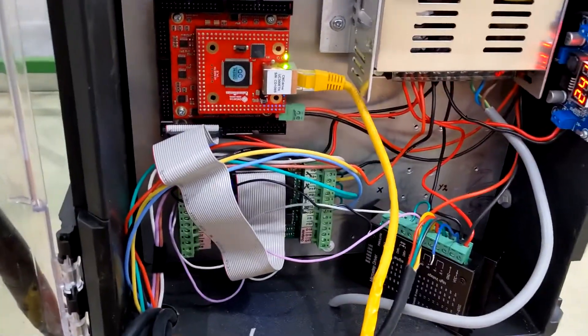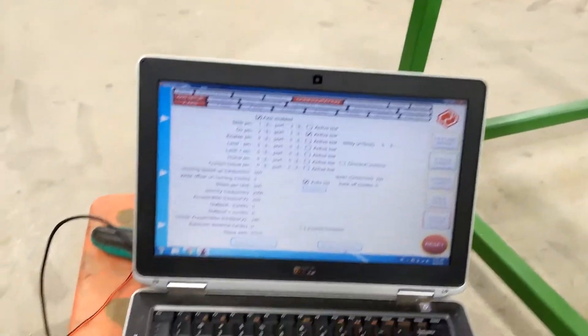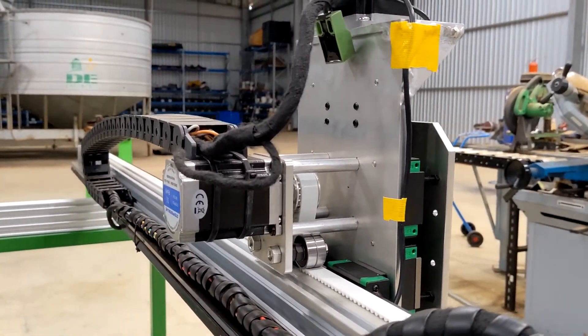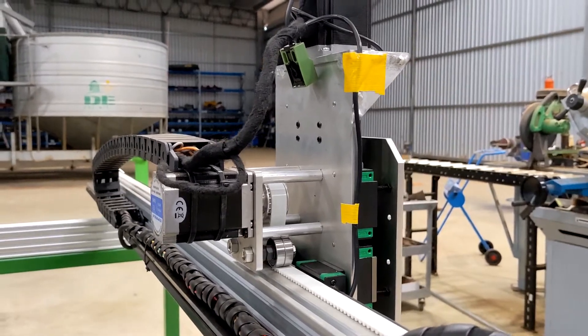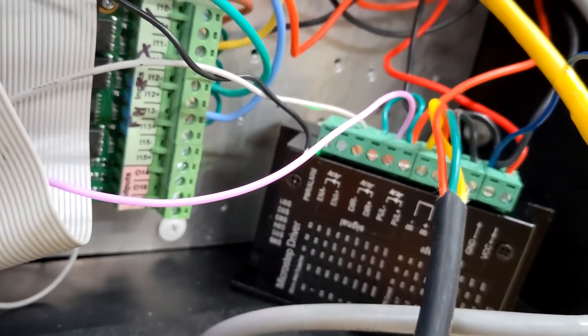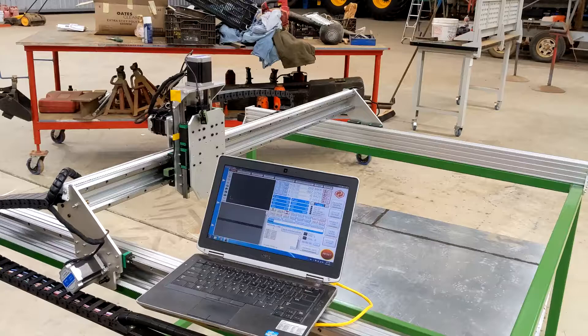After many unsuccessful tests, I finally got it working. Now I can just use these two buttons to control this, which is really, really great. My most recent fail was that I connected the enabled pins here, and this was actually what was stopping it working. Finally, I have got all my axes moving, which is really good because I had a fair bit of trouble getting the motor drivers working. But now I can control it.